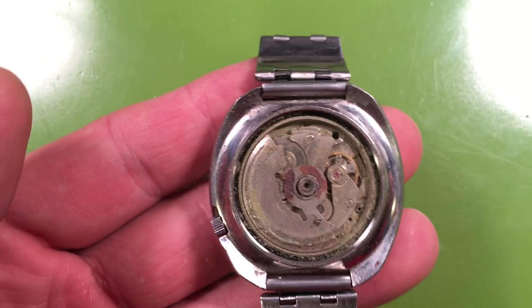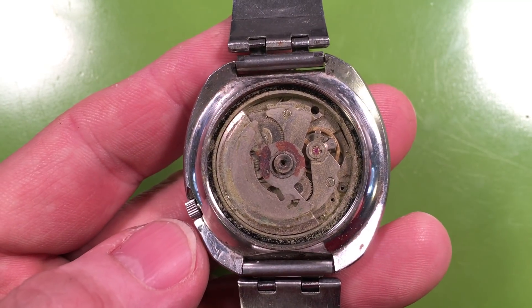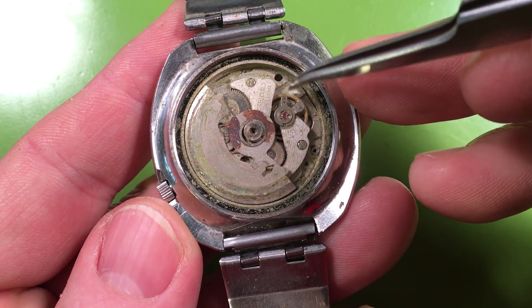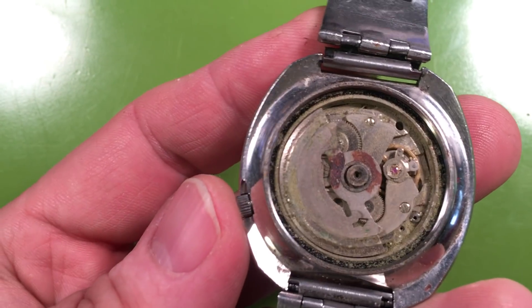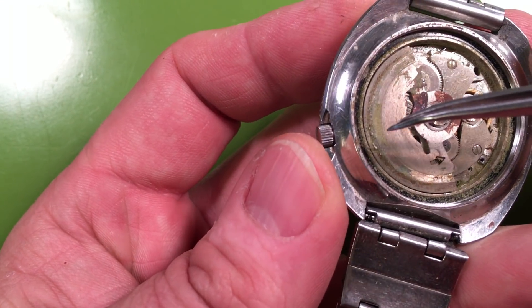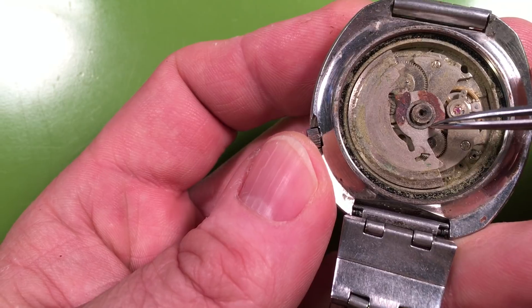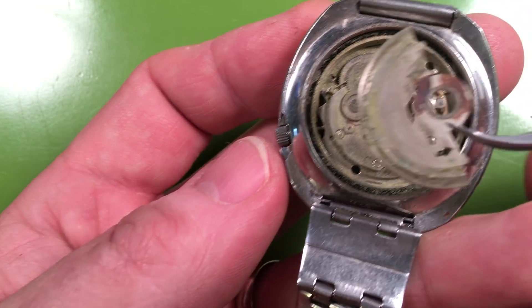Your other watch, the 719 — it is roasted, it is done. What is all this stuff anyway? It looks like pollen. The metal of the winding weight got water in it and just disintegrated — the whole weight fell apart. Look at that. Well, there's your problem.